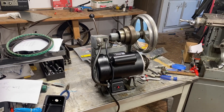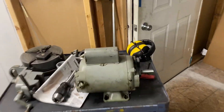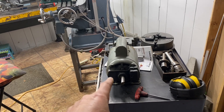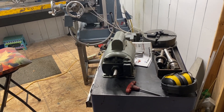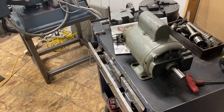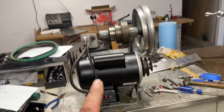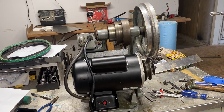It'd be nice to have the old motor on there since it looks the part — it's an old tool and that's probably the original motor. But to revisit why half horsepower isn't enough: I don't think I was getting a full half horsepower. I thought it might be the capacitor, which I replaced, and that might have made it run a tad stronger. But when you try to even take a 20-thou cut you can feel it bogging down. Either something is wrong with it or half horsepower just isn't enough. I need to be able to take a cut without spending all day doing 10-thou at a time — so now I've got a full horse. Three-quarter probably would have been fine, but more is better.